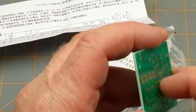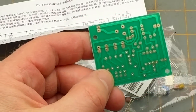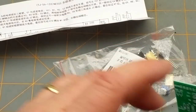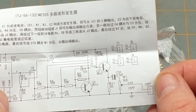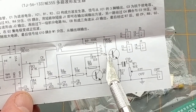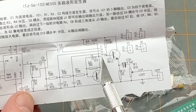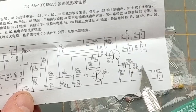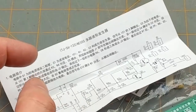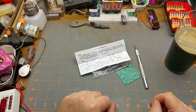The jumpers J1 through J4 all jumper to a common, and they all short across to the base of a transistor. That just routes whatever's coming out of those nodes through a transistor set up as a typical amplifier, then through an electrolytic capacitor, a level control, and out. That should be a fun little kit to build on some snowy day this winter.